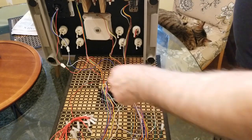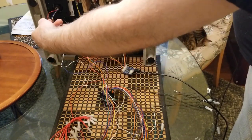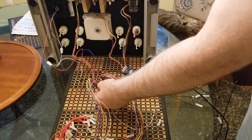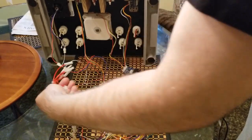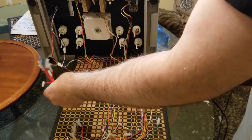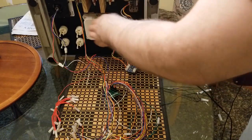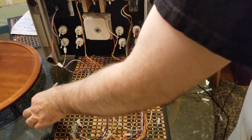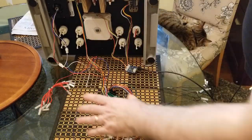One more thing. Every time you see a red wire, this is coming out of the joystick. This is for lighting up the joystick, and it goes to VCC, which is right here on this encoder board. And if you had lighted up buttons, you would use this linkage as basically your connector going around to each one. But we're not lighting up buttons. I don't have those kind of buttons, so you don't have to worry about that. This will just not be used.